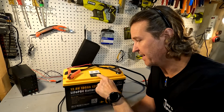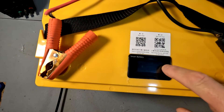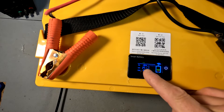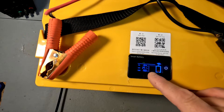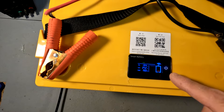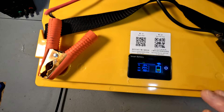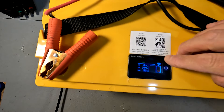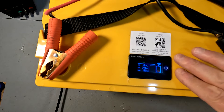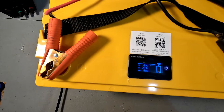While it's charging, let's look at the screen. When you press the button it puts up a display showing the voltage at 13.4, the current at 24.1 amps going into the battery, the temperature at 19 degrees Celsius, and it says it's at 48% state of charge. Since this is a smart battery, this should be accurate, but it's always good to charge all the way to 100% so the BMS can calculate what 100% actually is.